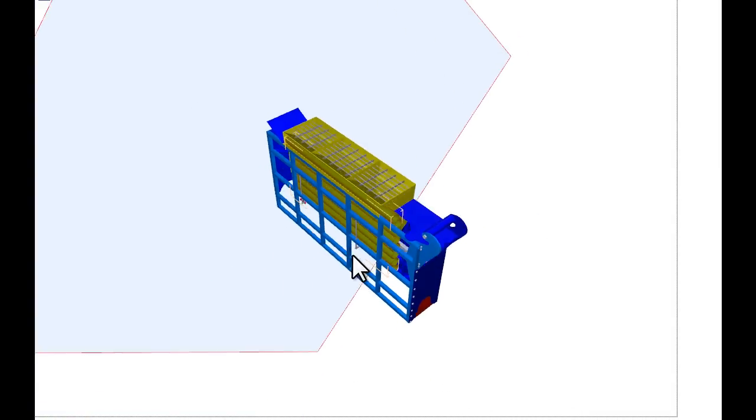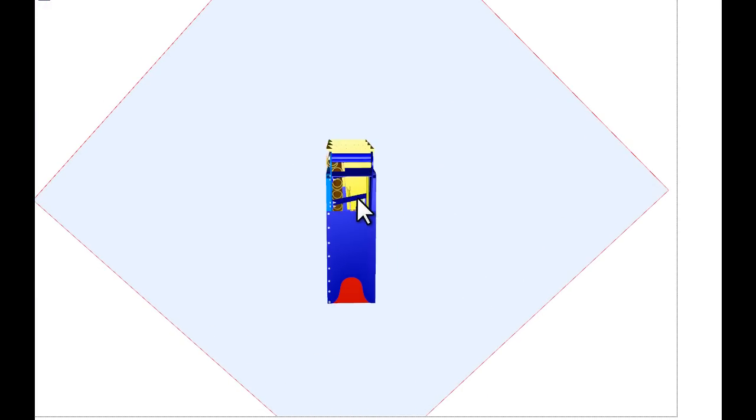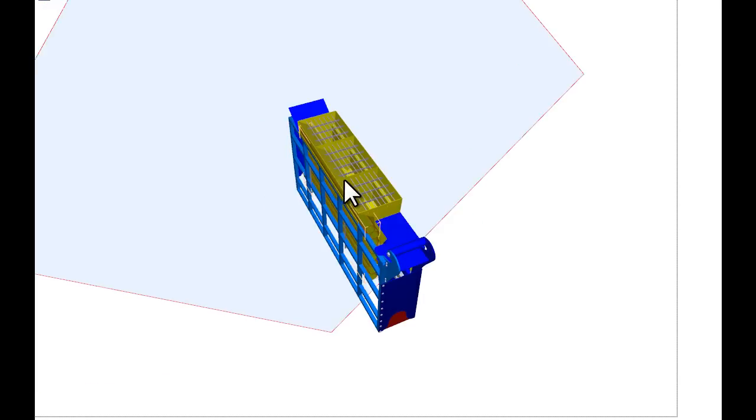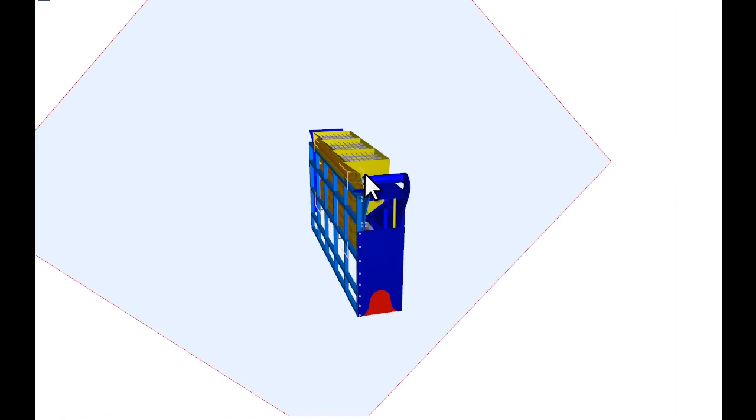Also for deep ditching, you can either put a box around this box and drag it with a ledge on either side, or we also have a top that you'll just set on here like a top of a frying pan, but obviously shaped like this, so that if any banks or anything want to cave in, they can land on that. You can lift it off and put stone in and set it back on in bad areas.